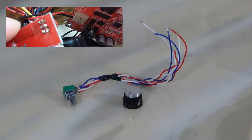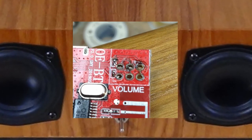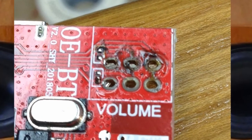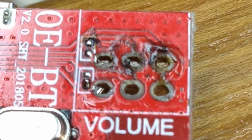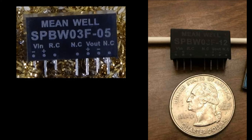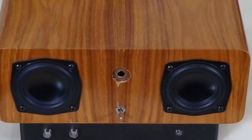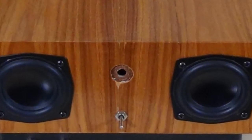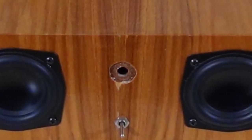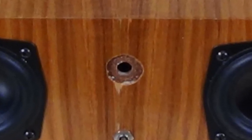I had originally intended to rewire the volume potentiometer so that I could have a really nice looking volume knob on the front. But I ruined one of the boards with my less than perfect soldering skills, and although I did get the second board to work, there was some noise, which is fairly common when trying to modify small devices like this. If I had a dime for every time I had to wire in an isolation transformer to deal with some kind of noise issue, I'd probably have 40 cents at least. Anyway, I'm left with a big hole in the front of this thing above the power switch, which I'll probably fix by putting an LED light in there so it doesn't look like I messed up — which I totally did. I should have tested the remote volume potentiometer out fully before drilling that hole in the cabinet. Lesson learned there, I hope.